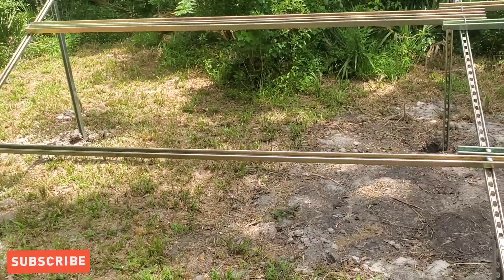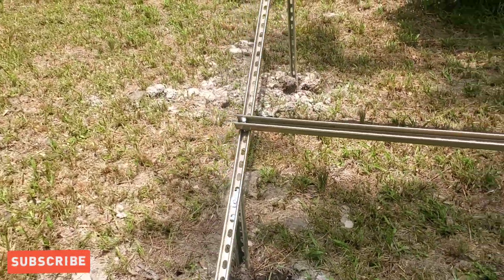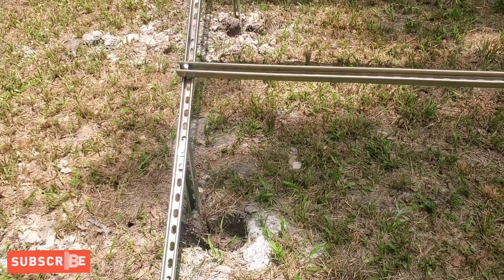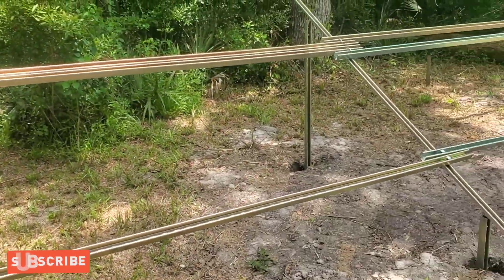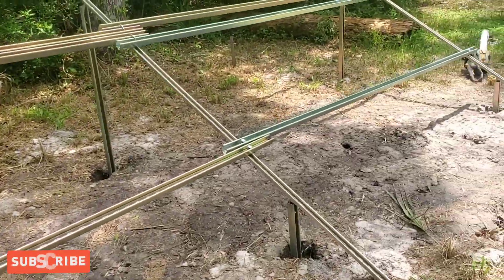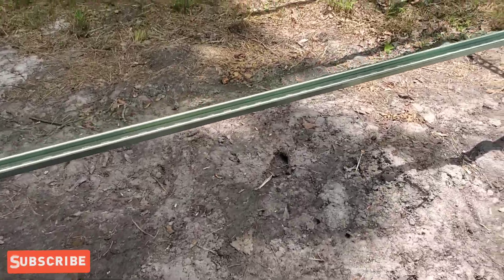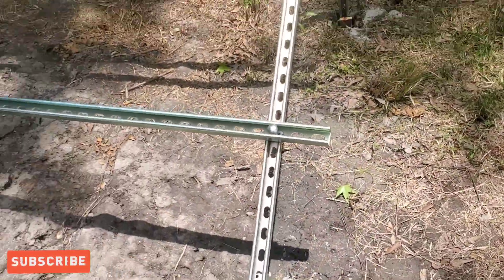I tried to see if I could go in today and pick up two EG4 inverters, but they told me it's a one-week lead time. So I'm gonna use what I've got here at the house — I'll use the Growatt. I already switched the EG4 batteries over to the Growatt inverter, and as soon as my dad gets here we're gonna put the panels up.